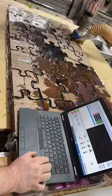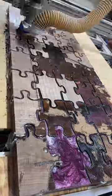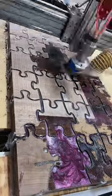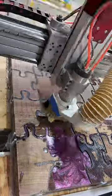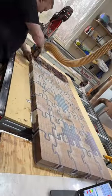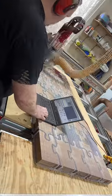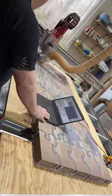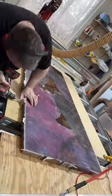Time for flattening. All the puzzle pieces were slightly different heights from different slabs, so I hit all the really high spots first and then put it into a pattern cut, knocking down high spots first — that saves about an hour. My router is five by five feet and the table is six by three feet, so I left a little off the edge to flip it and cut the top later. There's some art to this technique: as you shave thin layers of epoxy, the wood will twist slightly. Use shims at your match points — I use tongue depressors — and dog the corners down. It took about a year to figure that out.